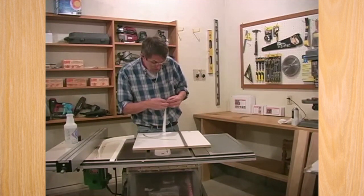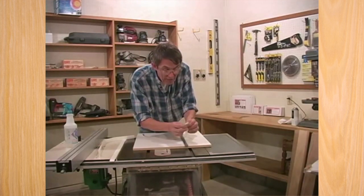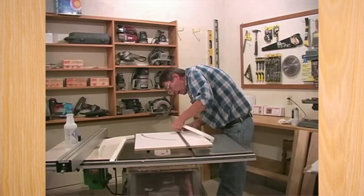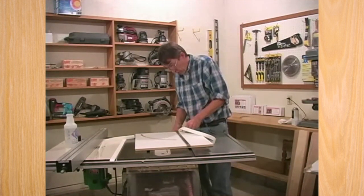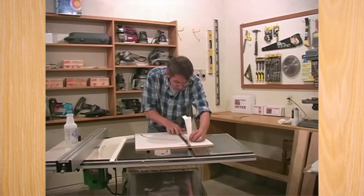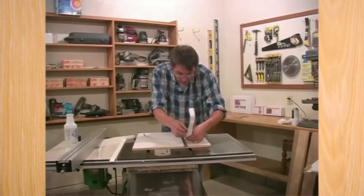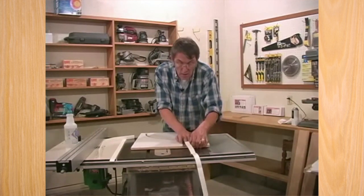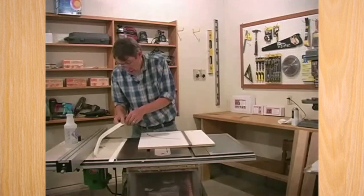Make sure your hands are clean or you're going to get fingerprints on these strips that will look bad. Take about an inch and a half of the mylar and start it right here at the very back edge — the side is going to be toward your stomach — and roll that forward so it attaches to the surface of the top. As I pull on the paper I can line this up. The main thing is to make sure you don't get any wrinkles or bubbles in these strips, because it'll make the jig slide not quite as easily and the strips will wear out faster. Make sure we're smooth on the bottom, then roll the surface right around to the top. We're going to do the same thing with the other two strips.